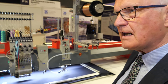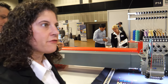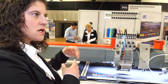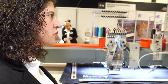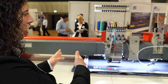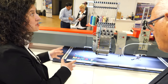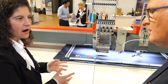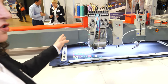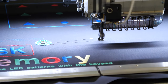Can you do large area — can it work reel-to-reel? We have machines that have a roll-to-roll system where you have the empty fabric going automatically roll-to-roll — those are more production machines. This kind of machine has all different available embroidery technologies on it, so it's the perfect smart textile R&D machine because you can play around with every technology. You can combine conductive threads with wires, so for R&D purposes that's perfect.